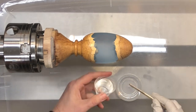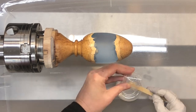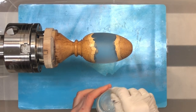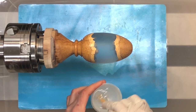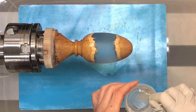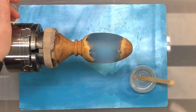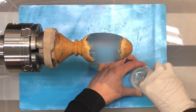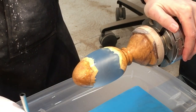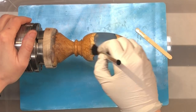It's pretty cold in my shop even when I have the furnace going. I kicked it up to 68 degrees because resin really likes it warmer. This whole sequence - actually most of this video except the very end - is sped up 600%, so I'm not stirring the resin this fast. I'm stirring it very slowly and thoroughly, trying not to introduce a ton of bubbles. I let it sit for a while and hit it with a torch on and off to pop whatever bubbles were coming up in my mixing container. Then on top of the shellac I painted a little thin coat of resin over the burl parts.